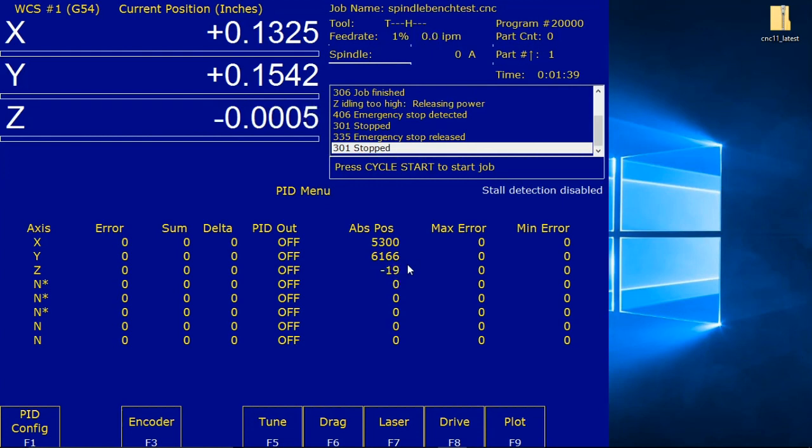If you're unsure of your motor counts, you mark or notate the position of your servo motor spindle. Let's see if I can get it back to 0 as close as I can. It's really touchy. There we go. Okay, so now I'm notating the spindle position. I see a slot on the spindle on the encoder pulley.